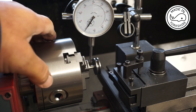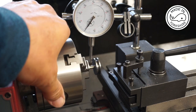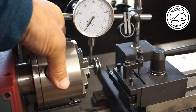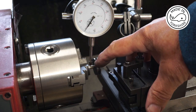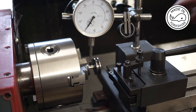I've just put the piston rod in the three-jaw chuck and I'm just checking run-out. There's less than half a thou there, so I'm happy with that. All I need to do now is nibble away at this edge here until I get a nice fit in the cylinder, but I'll do all that off camera.